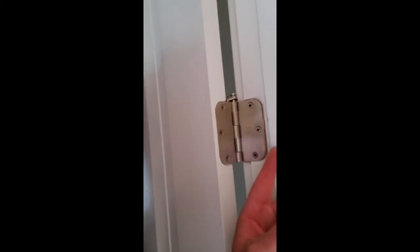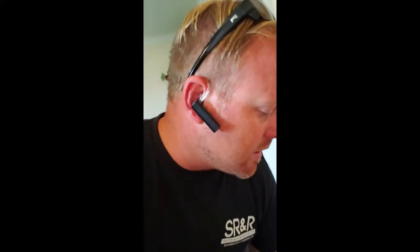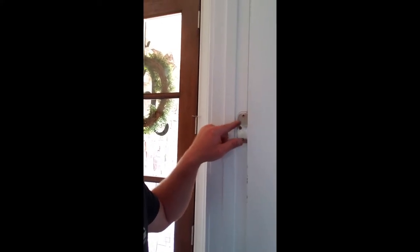So what I've done over here on the other side is I have moved these hinges out. What I do is take a shim and cut pieces — little shards like this — then pull the screws out. I fill those holes with all that little wood and then move the hinge itself over with my hand. I'm gonna try to show you guys how to do that.